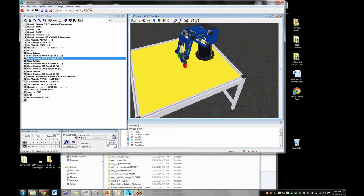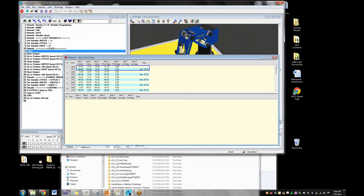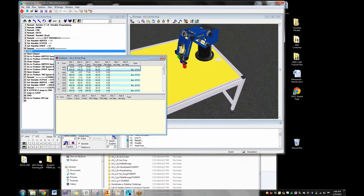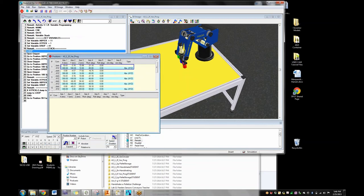Good question on how to do a loop. Concerning the out-of-Cartesian-coordinate-system error — we kept interpreting it as something wrong with the XY or Z location, and it turned out the gripper arm had tilted back and was out of range. We were adjusting the location of blocks, and it was in the envelope but something was still out of range. That's exactly what that error means.